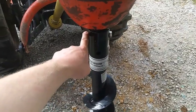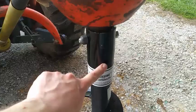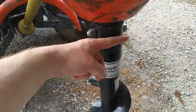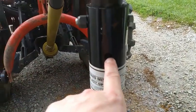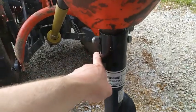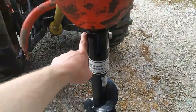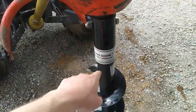I typically use grade two. Now a lot of these things, this one included, they've got two sets of through bolts. This is bolted on through the gear shaft and I could run another bolt through here — I'm not going to. I'd rather play it safe than sorry. I'd rather break a few shear pins than risk damaging the unit.